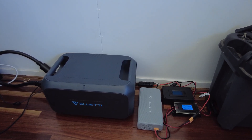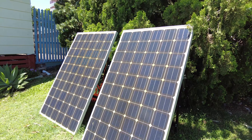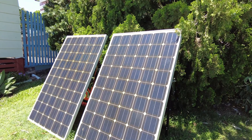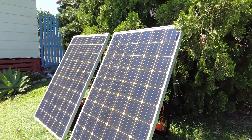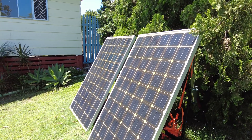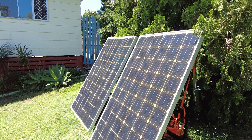We're going to have a look at the panels. Okay, so I've actually got two solar panel arrays at the moment — one driving the enhanced DC charger, which is these ones here. These ones are actually facing west. It's only just gone midday here so they've only really just come into sunshine and they'll probably hit their optimum production a bit later in the afternoon. Being where we are in central Queensland going into summer, we're going to get a lot of western sun, so having an array facing west is going to be a big advantage.